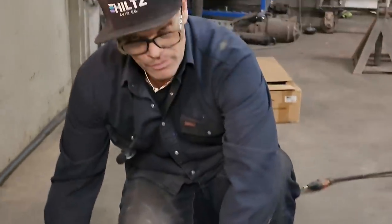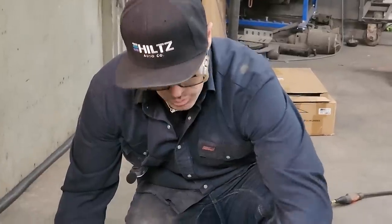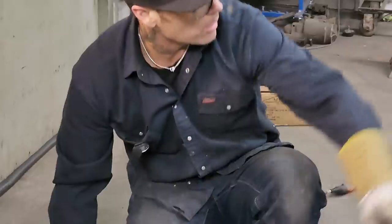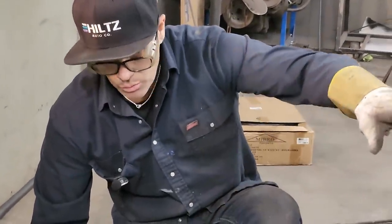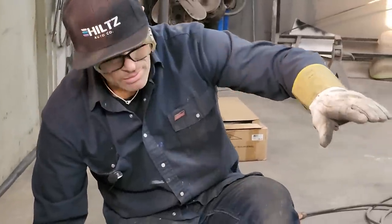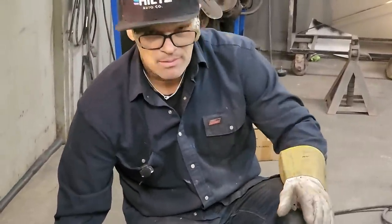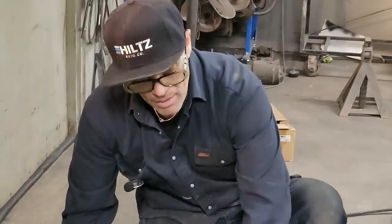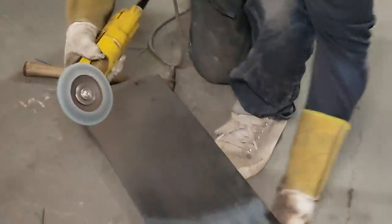I know what you're thinking. He didn't add any on to the rear of the running board to accept the back fender, and I did not. What I'm going to do is apply the running board, and then I'll add a little piece on the back of the running board. I'll butt weld it on like I did the tailgate, and that way I know it's going to fit. It's pretty hard to hold a piece of paper up against that fender when it's not connected. The running board's not connected. I want to connect the running board to the front fender, connect the running board to the chassis, bolt the fender on sort of where it's got to go, and then I can make that piece in the end and make it look nice in the end. That's my plan. I'm thinking it's an easier plan.